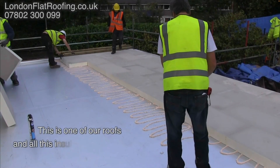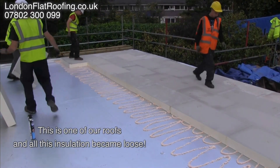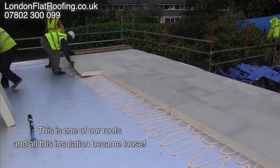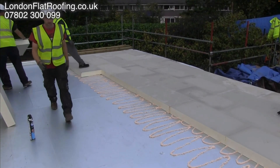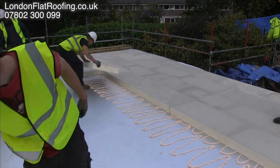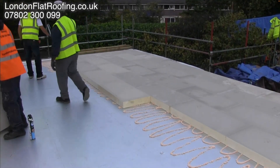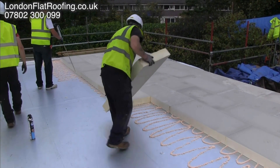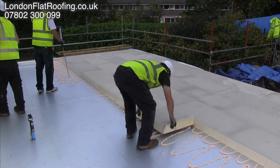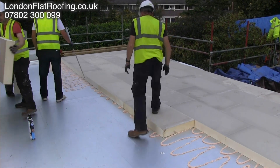This is one of our roofs - we did this a long time ago - and as you can see, I'm applying a lot more glue. I've talked to the suppliers of the glue and they've said their glue is compatible with this tissue faced insulation. I've talked to the suppliers of the vapour barrier, which is silver and hasn't got a grip to it, and they said it's not a problem and it will work with this glue. So we went ahead and did this on this particular roof. Even before I did it, I thought I'd do a little test section and make sure it works.